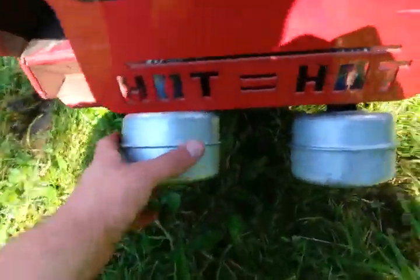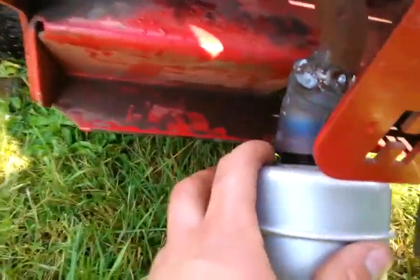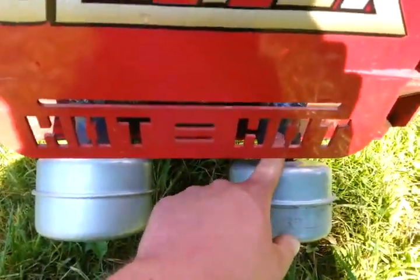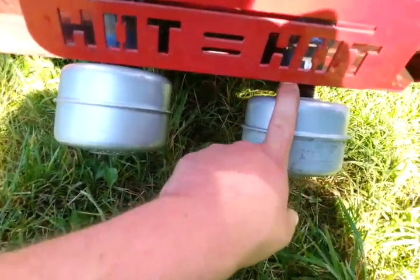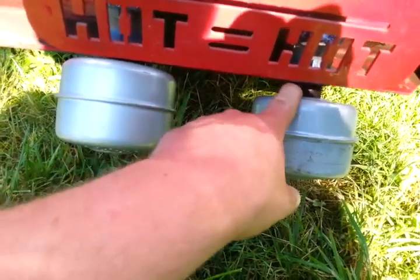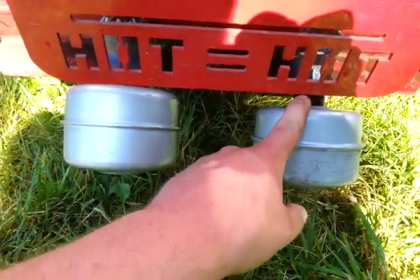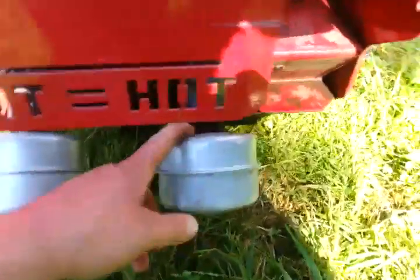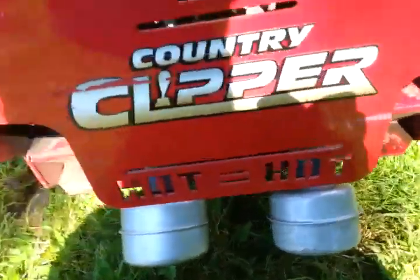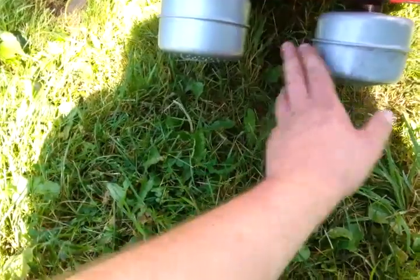These came out a little lopsided here, as you can see. For some reason this pipe nipple screwed in more than this one. I don't know if the end of the pipe is in the way, or I didn't grind it back as far, or I didn't have the nipple screwed in while I was welding the elbow onto the pipe — which is my mistake. Maybe there's some weld spatter in there. There were a couple pieces I knocked out, and maybe there's a piece I missed, but it's tight — it won't come off.